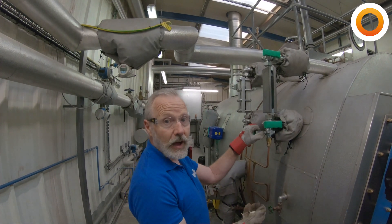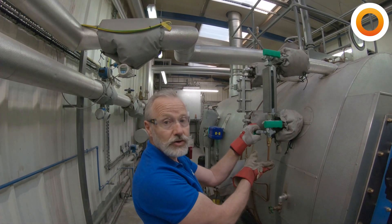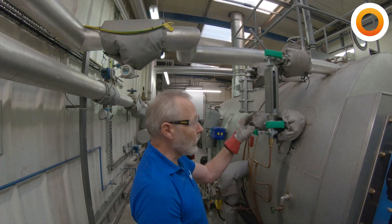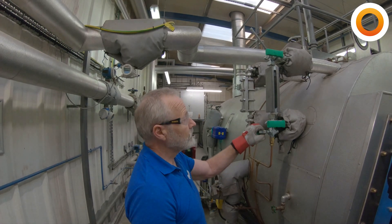When we open the drain, all of the water should drop out. The speed at which that happens is an indication of how clear that drain is — if it's moving sluggishly, you've probably got a blockage building up in the drain line.